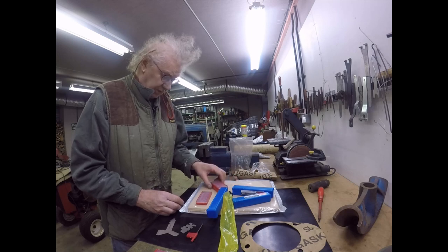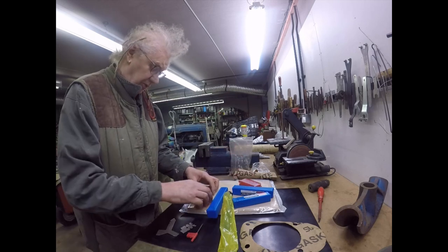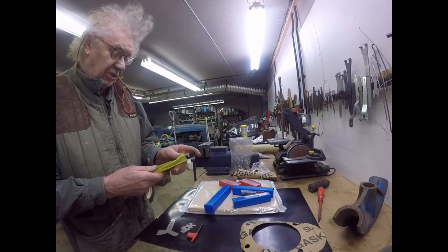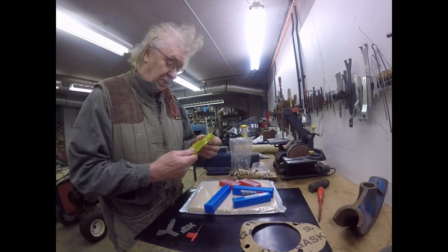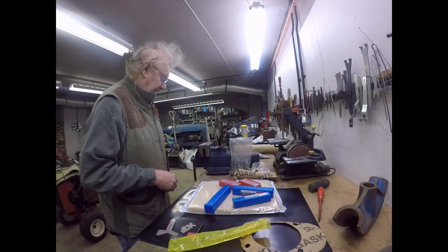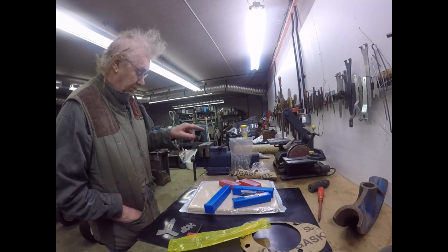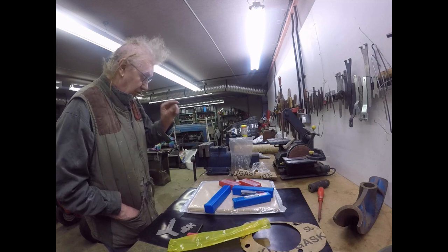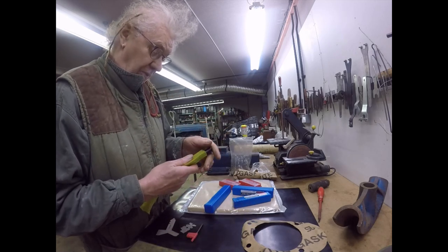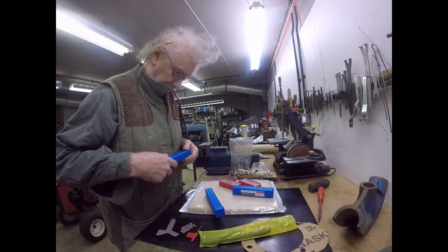I've got 55 degree inside and outside cutters, 60 degree inside and outside cutters, an inside threading tool, about which I'm a bit dubious because if you sit it on its flats, it looks like it's going to come out with pronounced negative rake, but when you actually put an insert in it, it looks different. So I'm reserving judgment on that one. These things weren't expensive. I've also got an external threading tool.